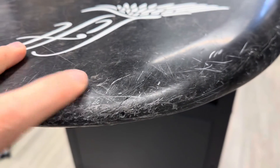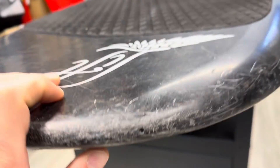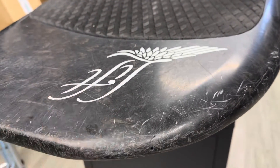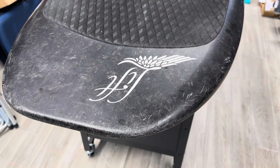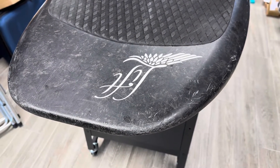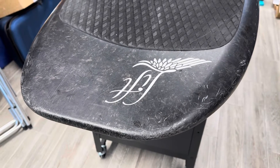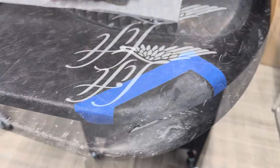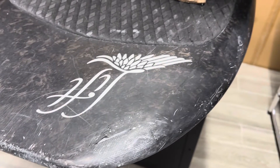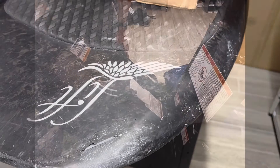Once the holes are patched, we can move on to testing on the water. If you're curious how to do an epoxy resin repair on an e-foil, I actually made a video about that exact subject. On this one, I'm going to use some fiberglass cloth and some filler for the big hole, and straight epoxy resin for the other ones. Black is really easy because when you sand it out, it just kind of matches — you sand it down so it's glossy and you're good to go.